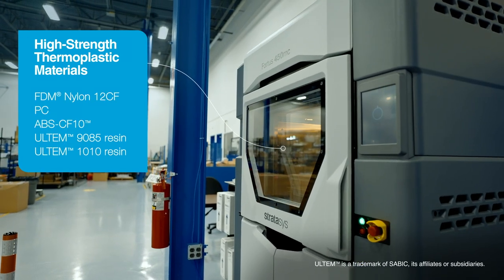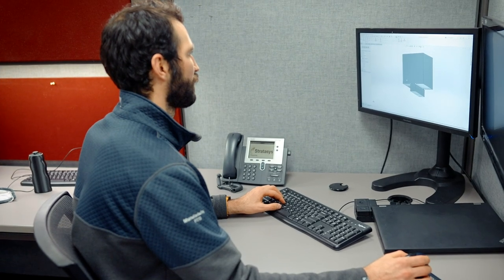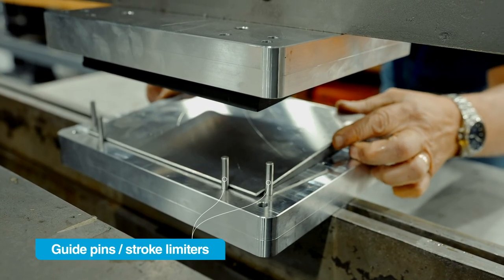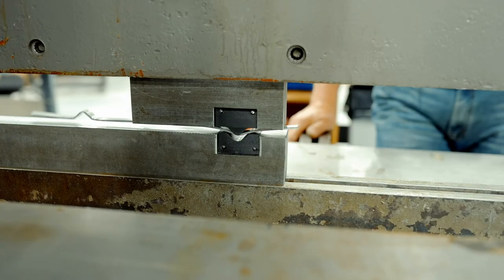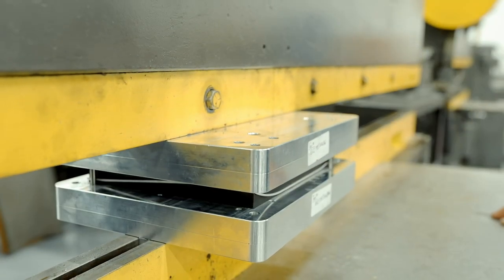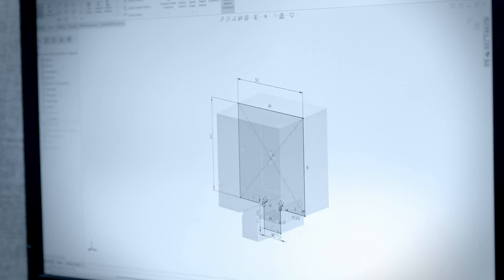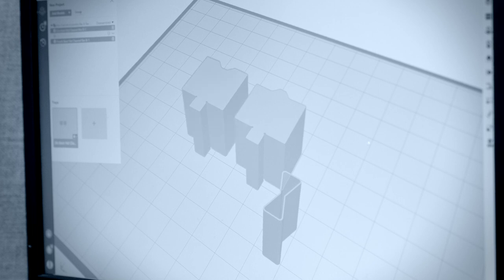Based on the requirements of your forming operations, Stratasys has several high strength thermoplastics available to choose from. Here are some considerations when designing your 3D printed metal forming and press brake tooling. Create your tool using the same design philosophies used when designing metal tools. Be sure to include guide pins and stroke limiters where necessary to prevent tool damage. It's preferable to make the tools as a single 3D printed part to prevent weak spots. Under the forming pressures, an FDM tool may have a small amount of deflection that decreases or eliminates the amount of spring back in the sheet metal component. We recommend designing your tool with no spring back compensation and adding it in if necessary after testing. Part orientation is important because it affects the compression strength of the final part and also affects the surface finish of the tool, which could transfer to the formed part depending on gauge thickness.